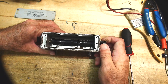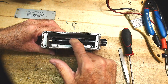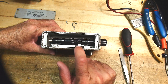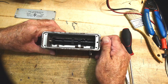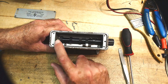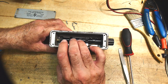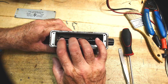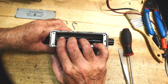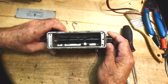The way it does that is with this cool cam. As we rotate the knob, these different cams toggle in and out. There are three attenuators being swapped in and out in some pattern. You can kind of imagine this as a three-bit binary — but that would give you only eight positions, and there's 12. So how do they do that?